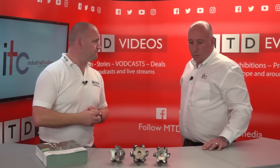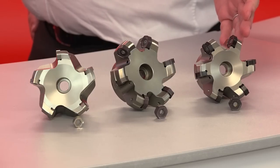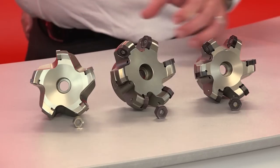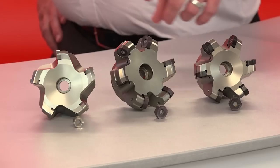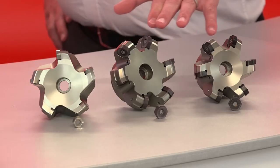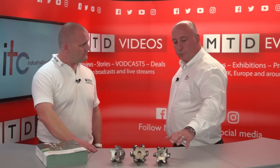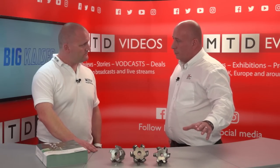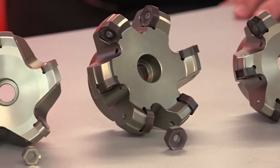We've got the M1200 in two different sizes here. We've got the larger insert size, both in 80 diameters, and we've got the smaller insert size, again 80 diameter. One key feature of this tool is that we have different styles of bodies which still take the same insert. We have a 15 degree lead for high feed, a 45 degree for general machining and finishing applications, and a 60 degree body for higher depth of cut. So we can actually suit the face mill for the application, the machine, or the material.